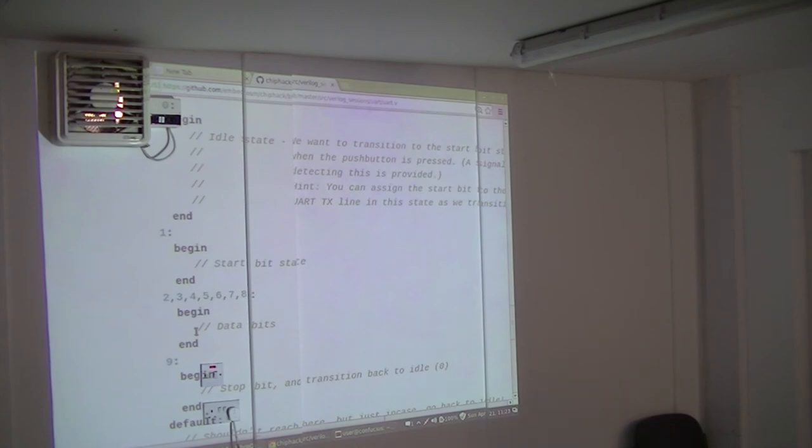For those of you on Linux, it's very easy to run the testbench in that directory. You can just type make run, and there's a little UART decoder that will run and tell you what you're transmitting. I should have put a timeout in that file, actually. For the rest, let's fire up a Quartus project and go through that rigmarole.